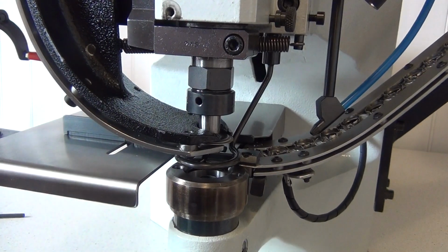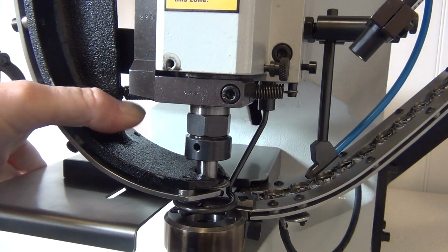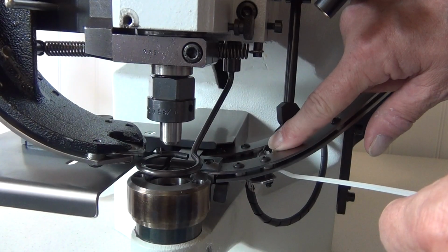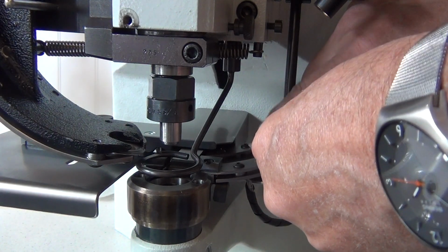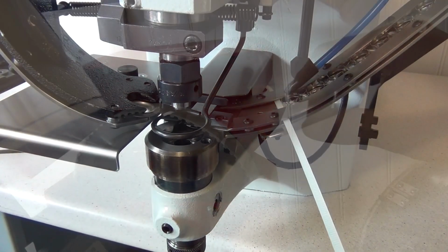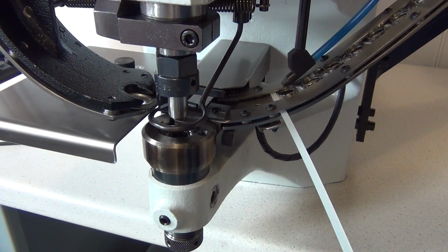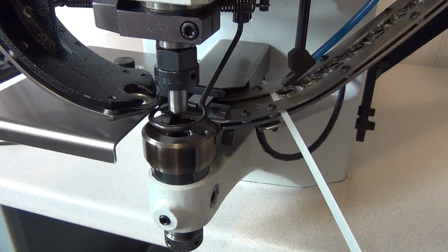We are next going to do a test cut of our material, so we don't want an eyelet or washer to feed into position. Move the eyelet raceway away from the die set and use the puncher to hold it. You can easily stop the flow of washers by placing a wire tie into the raceway as shown. There will be one or two washers already in the slide mechanism. You can remove these by opening the cover over the flywheel and moving it manually. Here you can see a washer eject. This can be removed with long-nose pliers.